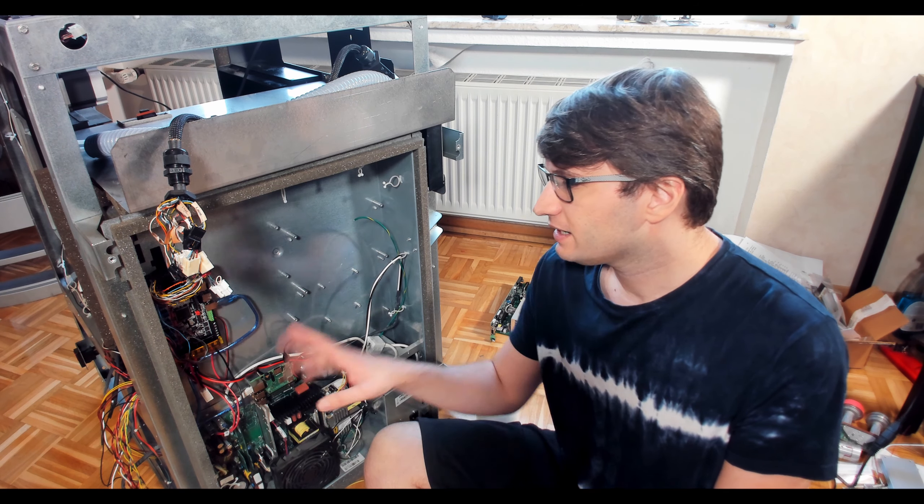Now I'm going to the printer to show you my plans. There are three original power supplies on the Stratasys printer. I'm going to start with the biggest one — this is the 24V, 10A power supply. We're definitely going to be using this one for the motors and for the extruder heaters as well. This power supply is going to be exclusive for those.